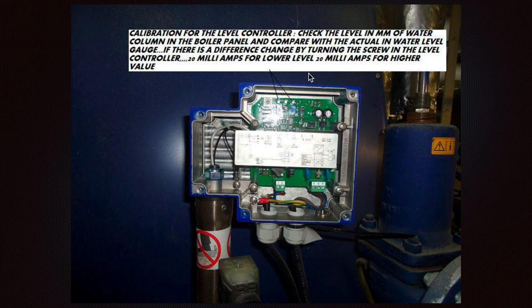At the lower level you will set it to 4 mA, and you must also check that the gauge shows the same thing as the actual water level — what the controller sees must match reality. The controller does not see any level on its own; you are the one who sets it up. It is really necessary to always check the actual readings against the electronic readings to make sure they match exactly, and also to test them in other ranges.